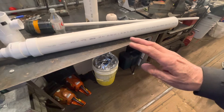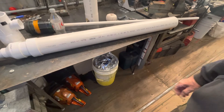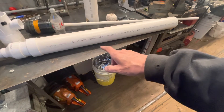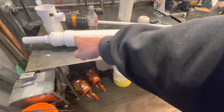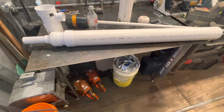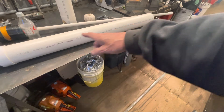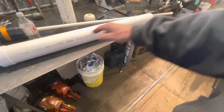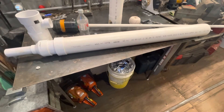I was able to blow up about a 50-gallon bag in less than a minute, so it goes pretty quick. I'm going to experiment with some other designs that might be a little better. On this one, you could actually build two check valves — one tube on one end and another tube on the other end — with the piston in the middle. It would flow air out one side on the push stroke and the other on the pull stroke, giving you double the airflow with one full stroke.